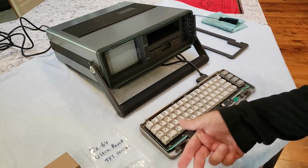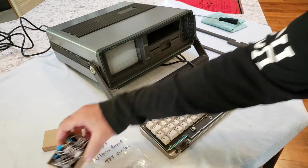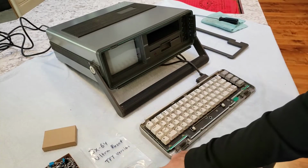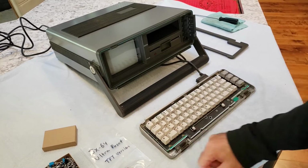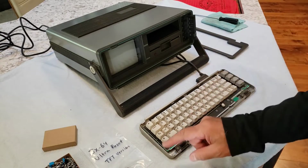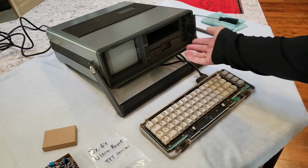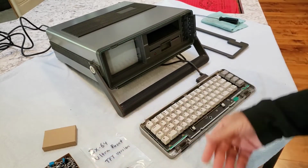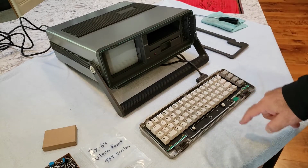Otherwise, typically when you install JiffyDOS, you'd have to put in a toggle switch. That's why these things come with toggle switches. But in this case, with this little device that electronically handles the switching, you can use the reset button to switch devices between 8 and 9. And you can use the reset switch to also choose between the JiffyDOS kernel and the SX-64 kernel. So that's what we're going to be doing.